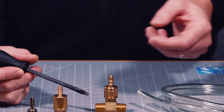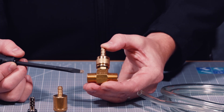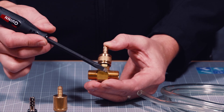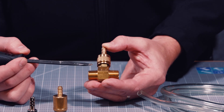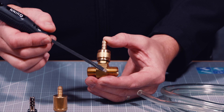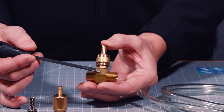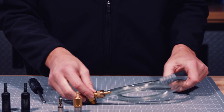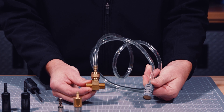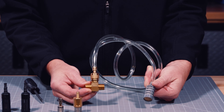In order to use a chem filter, it's very important that you have a chem injector — and all pressure washers have a chem injector. They look something like this; this happens to be an adjustable version, and it would go after the unloader. This one is marked as a 2.3, which indicates it's for a higher volume machine. There's a nozzle on one side that creates a vacuum through the Venturi effect, drawing through your chemical tube and hence through your filter. Its most basic design would look like this, with the chem injector pulling from a hose attached to your chem filter, which is dropped into your tank.